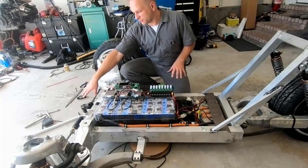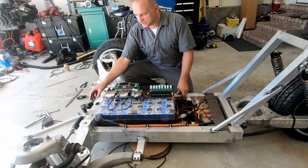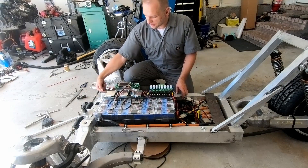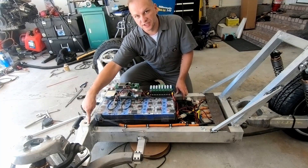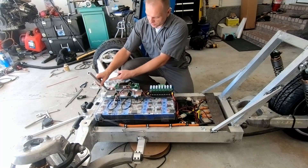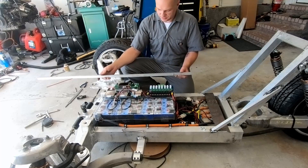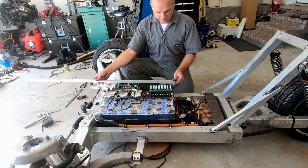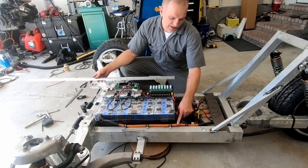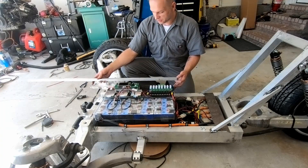So the next thing we're going to do, now that we fixed this and it's turning the right way, is create a cradle for our steering mounts. That's going to entail two tapered mounting points here and here, then we're going to drill down into this, tap it, and mount it down. We're going to come in right about here where it's covering our electronics and protecting them, then run the bar back to right here and do a drop length so we can tie off into here. I might bring it out a little bit so it mounts up on the sides — maybe I'll do that on both sides — but it's going to be something along these lines.